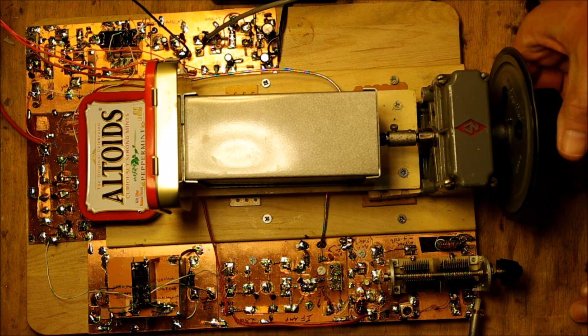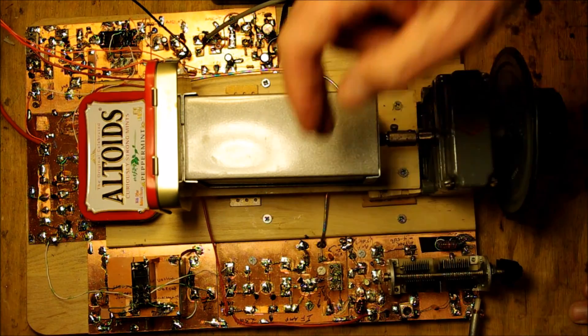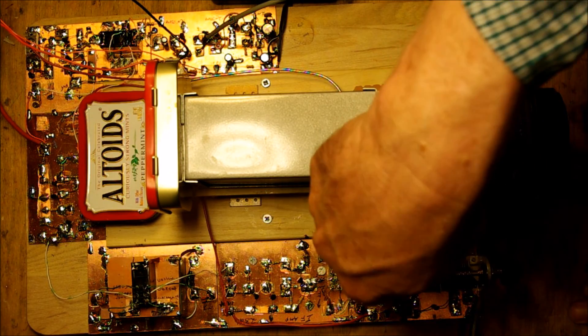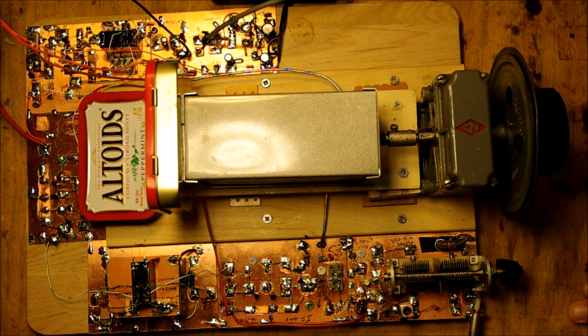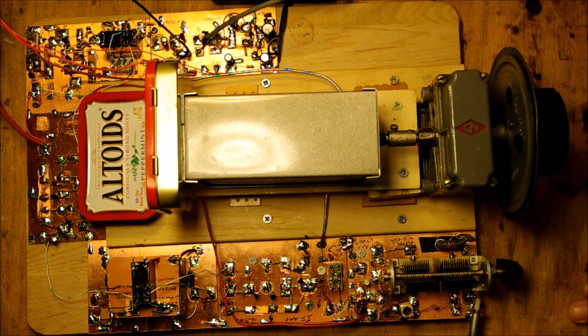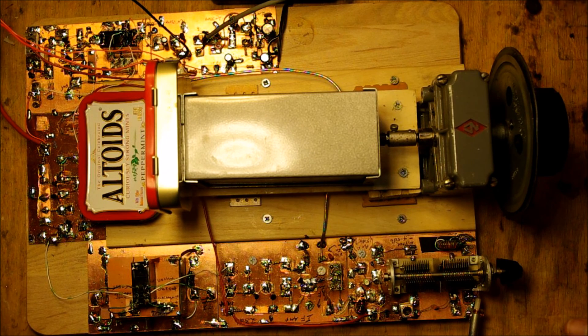Anyway, I'm having fun with this thing — it's not quite done yet. I've got some problems to work out: got to arrange for the broader filter response, get the diode detector going. I think I have too much gain ahead of the mixer, and strong signals in the band sometimes overload the diode ring mixer. So I've got some dynamic range problems that could probably be taken care of with a little less gain or an attenuator somewhere before the mixer. Anyway, that's it — hope you guys like it. 73 from northern Virginia.